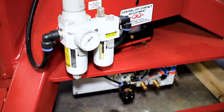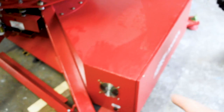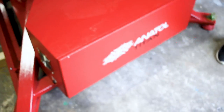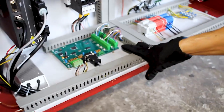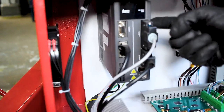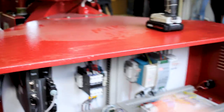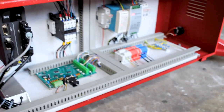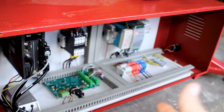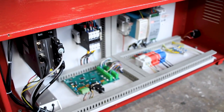This is all your drive — you've got a servo amplifier in there. That's your index PCB board, which controls that drive, and this is your amplifier. Your main control panel talks to this board, this board talks to your servo amplifier, and that sends the pulses for the motor. It's actually a screw mechanism — just imagine a big screw going back and forth. That's basically how the servo drives work, whether it's a Bolt, Titan, or whatever the other machine is.